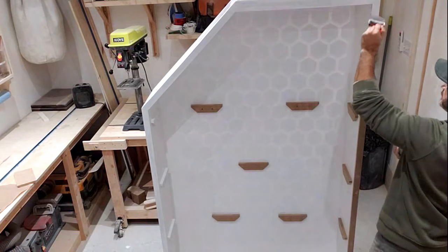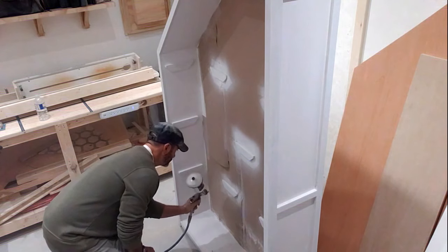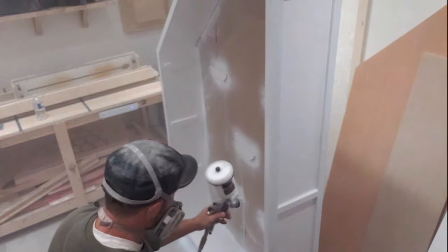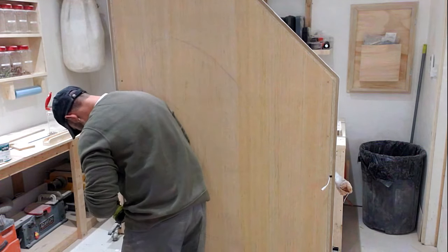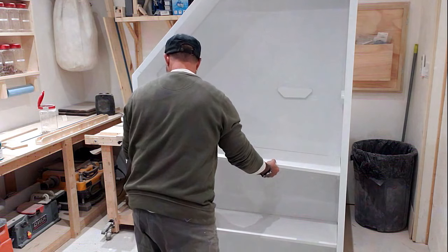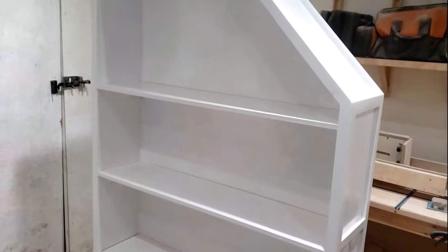Next I cut down one-inch strips of MDF and trimmed the entire outside — every corner I found, I trimmed it up. Then I filled in all the holes with wood filler. One of the reasons I love working with MDF is it's so easy to manage, work with, and make look nice, clean, and simple. After that I threw on these 45-degree-looking holders around the shelf to give it a uniform look. Then I pulled out my sprayer and brushed on the original coat of primer, because MDF is like a sponge — it soaks up whatever paint you're using. Always use a bit of cheap primer for MDF; it'll really make your next process a lot cleaner. After that I took the backer board and put it on the back, and decided to try it all together now that the shelves were in. This was awesome — I was so happy.